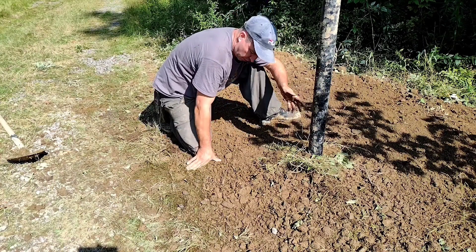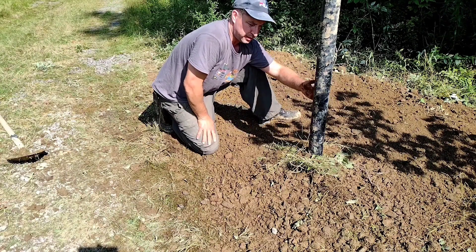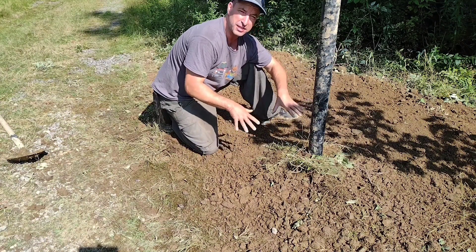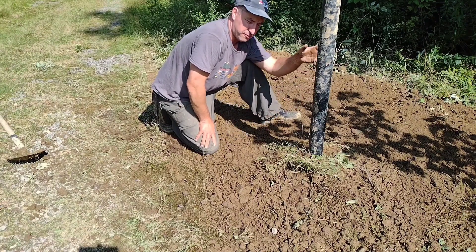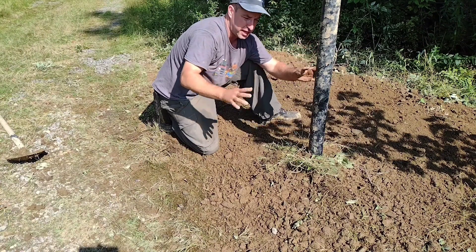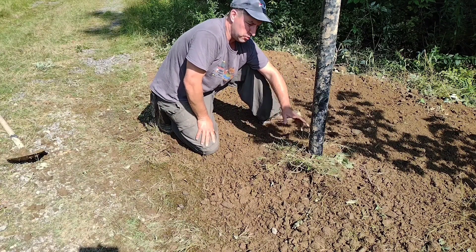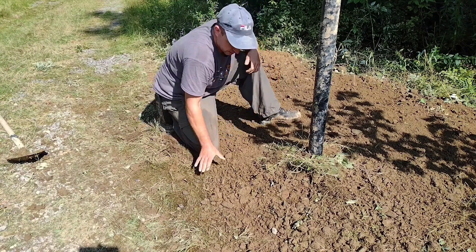We'll have to let this go over winter to see if we get any movement by next spring, and I'll do an update at that time. We're down below the frost line, and I think we did a great job solidifying this with rock. This shows anyone on the channel how to put in a post — whether for a gate, a load-bearing post, or any type of post — and do it yourself without even using concrete. Thanks for watching, like and subscribe. Cheers!